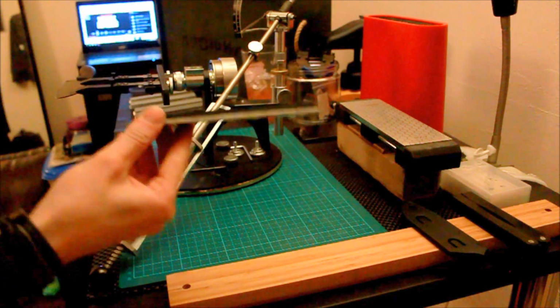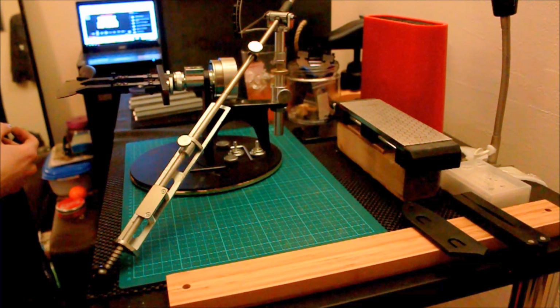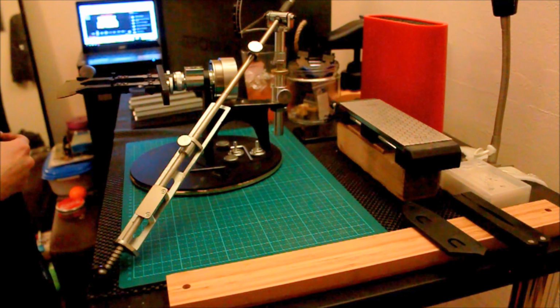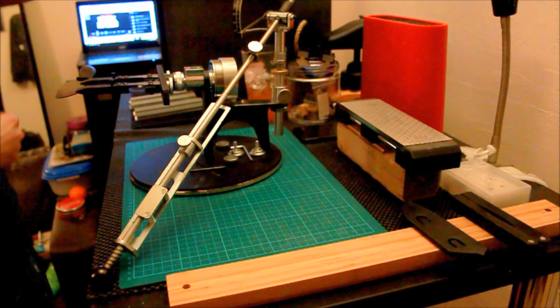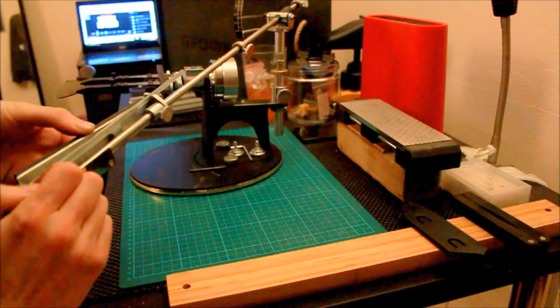It is better to use these stones wet. So up here I've just got a little pool of water. I sit the stone in there, you see bubbles coming out of the stone, and you just wait till the bubbles have settled off. This one was already quite damp, so not too many bubbles in there. So now we'll attach this on here.